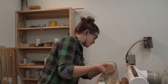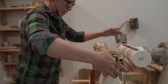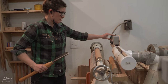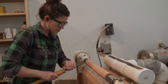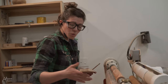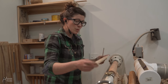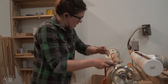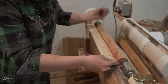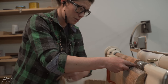Just like we did before, we're going to stick it in between the two centers on the lathe. We'll get it nice and tight without stressing it and creating tension in between — tighten the knobs. When we're trying to turn extremely quickly and efficiently, or when we're turning a bunch of the same parts, we get to use a story stick. This is for our double bobbin legs. I'm going to make a series of marks that match the story stick, then size each section down to the measurements on it, and then turn the shape.